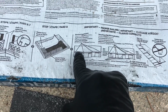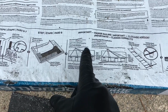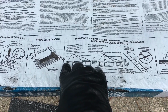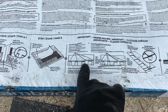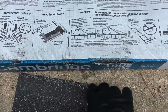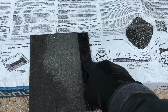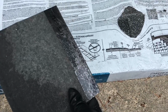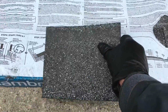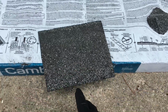So you nail them, some shingles actually have a slit that goes the entire width, or these ones, I don't think these ones do, or sorry, I know they don't, but you nail on the ends, and then right there on these edges, so that the next layer is overlapping those nails, right? And each layer of shingles is gonna have a little bit of a sticky kind of adhesive to them. And that adhesive, you can see it there, it's kind of shiny. This black adhesive sticks down the edge of the shingle. So when you lay the shingle down, the nails should be on the inner edge of it, so that these stick down and water's not gonna get up and in there.